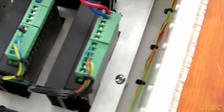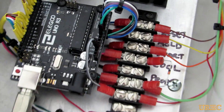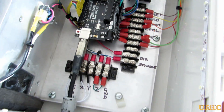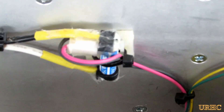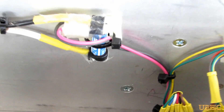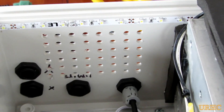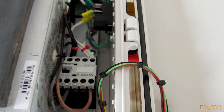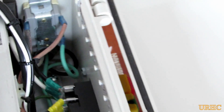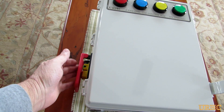I picked up another one of those stepper drivers from Amazon for about $16. There's actually room for a third one and everything's wired in place for a third one also, so it would be easy to make this a full three-axis control. There's a little reed relay that I added for the Arduino to control the 110-volt coil on the contactor. Everything really fit in there nicely, and there's a piece of foam on top of the power supply that divides it off just to keep the air flowing through the cabinet.